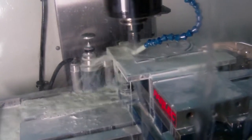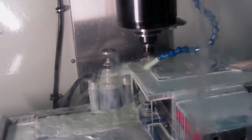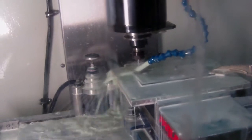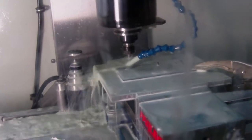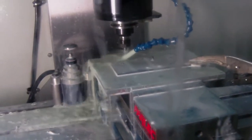I saw you press spindle minus 10, or maybe minus 10 feed rate. I don't know which. What magical button did you press? I'll show you that. This is spindle and that's speed. I did that one. Okay. And if you want to bump it up, hit that. Is the 10 just a fixed unit? Oh, it's percent. Okay. Yeah, and hit this, and you can do it by the handle.